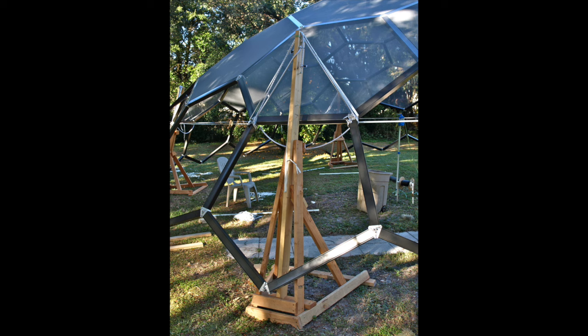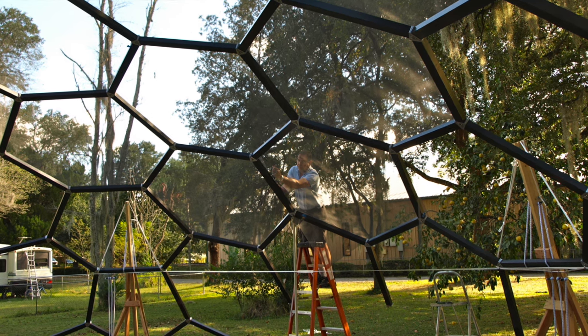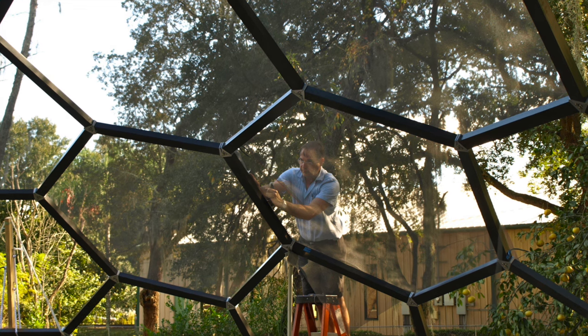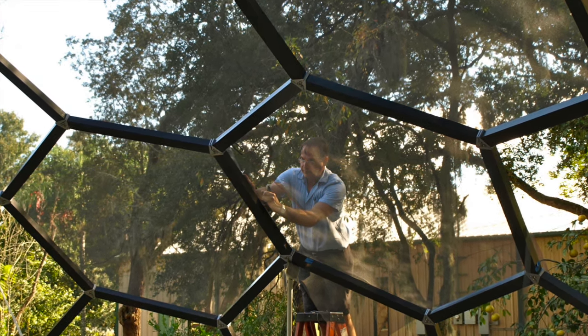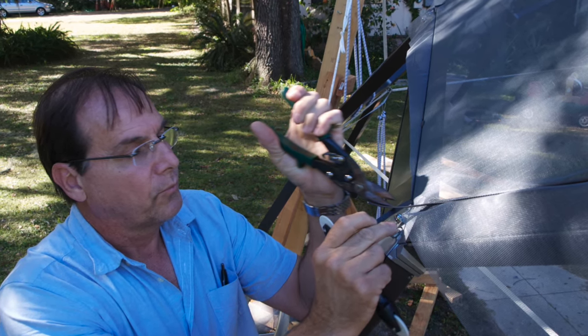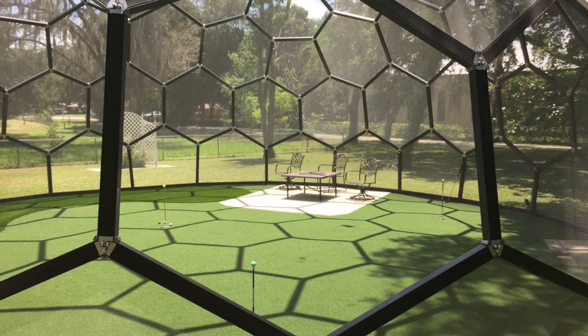Putting the jack stands on the inner side of the dome also helps. The screening of the panels adds much stability to the dome during assembly. Making or purchasing an internal protractor can help verify a panel's position before being screened, ensuring accuracy during assembly. A pentagon will always have five similar internal angles, while a hexagon will have pairs of similar internal angles.